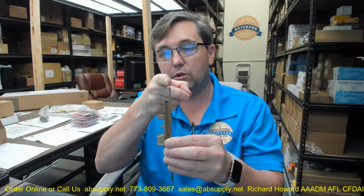You're going to need to get in there and probably knock back some insulation. But you shouldn't encounter any other trouble. If you're doing a door with a flush bolt prep, or doing a door with an astragal prep, you're going to prep this directly to the astragal. The mounting tab that you use and its offset will probably have to be accounted for, since you're installing it onto a thinner astragal. You might literally have to pound that mounting clip a little flat, and depending on your door construction, there are different door constructions.